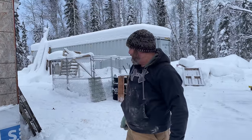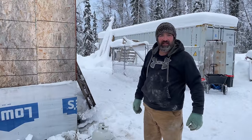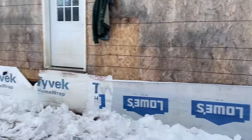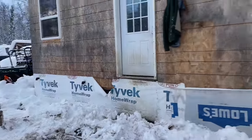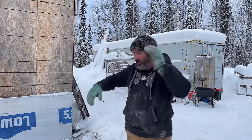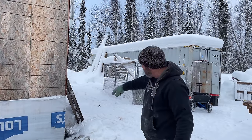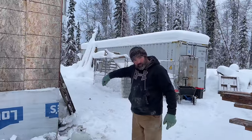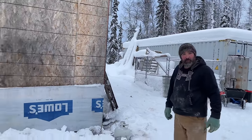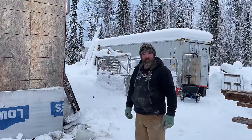Okay. Alrighty. What's the next, boss? Want to help me get a measurement? Yeah, definitely. So we'll measure that first beam, the middle one. The center of these two saddles. Oh, okay, got it. And then these next two, we'll let them kind of come past, and then we'll cut them off. We'll use the side of the house as a gauge, and we'll cut them up. So this front beam is going to be in three pieces. Three pieces. Perfect. Uno, dos, tres.